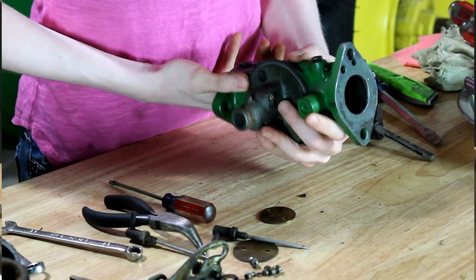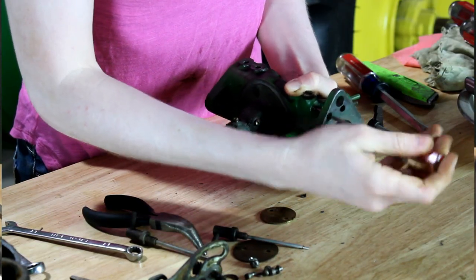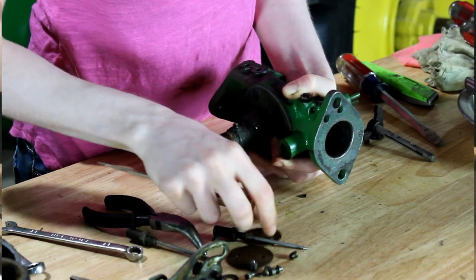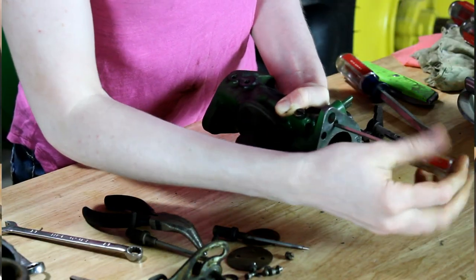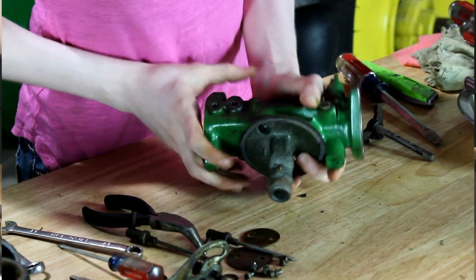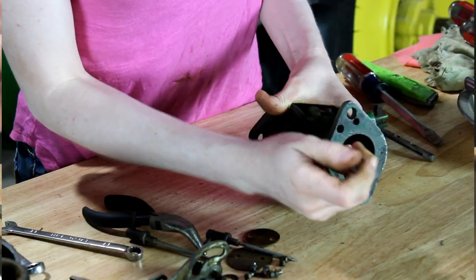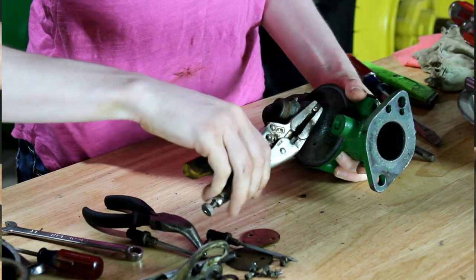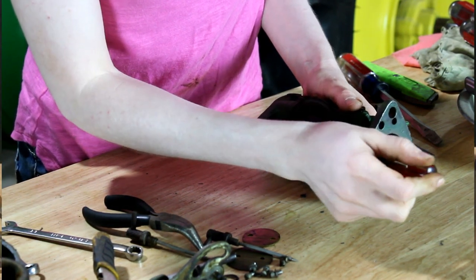On a John Deere, it's really important that you use a screwdriver to take these jets out so that you can adequately clean the passageways. A lot of people might be tempted when rebuilding a carburetor to just buy a basic kit, install those parts, and call it good. But if you want your tractor to run right, this step is really crucial — you have to get it clean and clear those passageways. Sometimes these screws can be really hard to get out. You can use heat if you need to, or use a small pair of locking pliers to lock onto the screw. But you've got to stick with it and get these out — it's absolutely critical to the rebuild process.